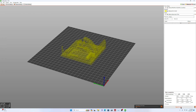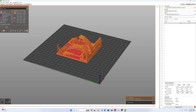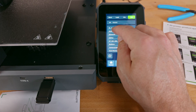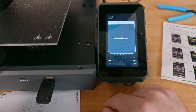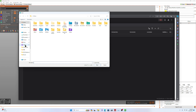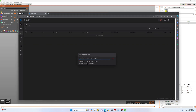I sliced the model using these default settings. Though I could load the G-code onto the included flash drive, the flash drive provided is well... crap. Since the printer runs Klipper, has Wi-Fi, and includes internal storage, I opted to connect to my network. By entering the printer's assigned IP address followed by a colon and port number into a web browser on the same network, I gained access to Moonraker — the Klipper interface. From here I can go to Jobs, add a job, upload the model directly, and begin printing.